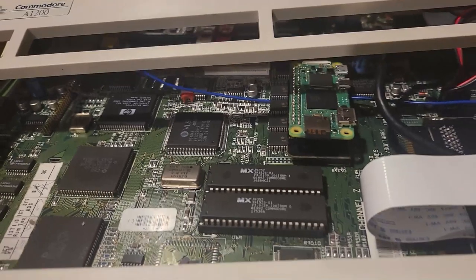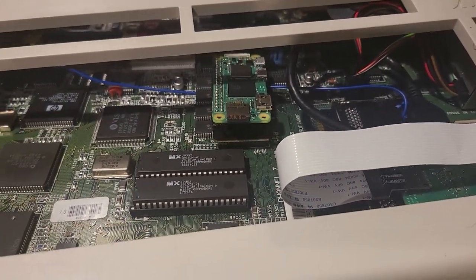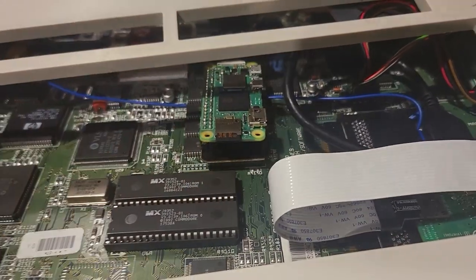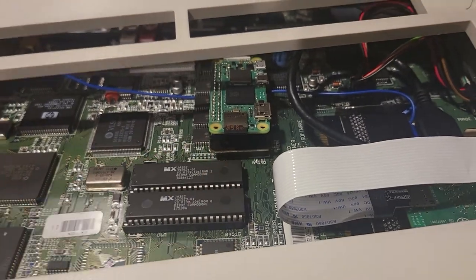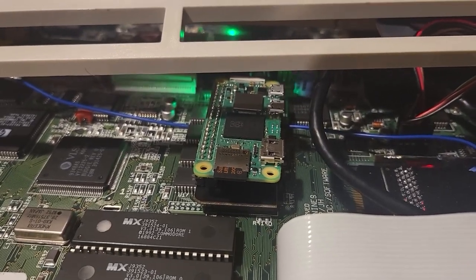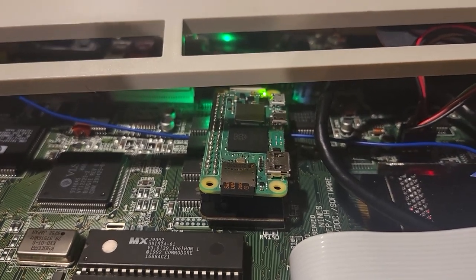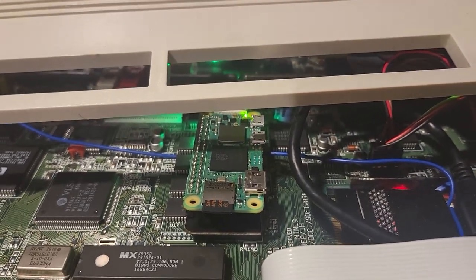I had an issue while trying to use the first command to check the card. The card wasn't recognized, so I decided to take a look, and the LED on the A314cp was lighting, but not the one on the PI. So I removed and reinserted the SD card, and now, as you can see, when I boot the machine, I got the LED from the A314cp, the one down there, and one from the PI too. So it's booting. It should be solved.